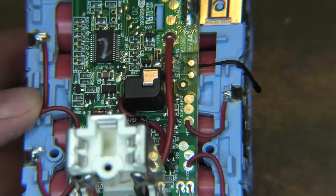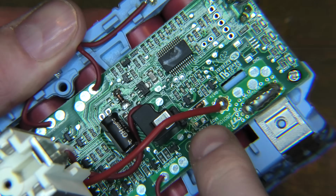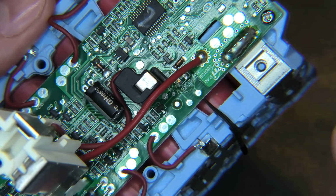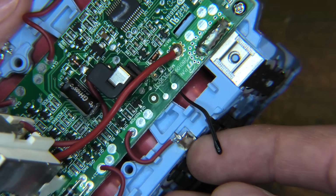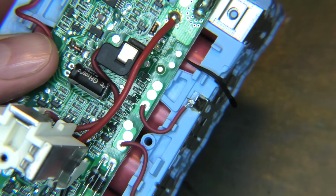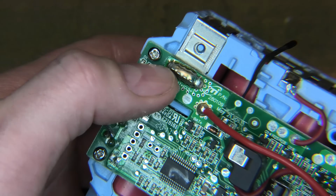The last thing I tried, I didn't record it, was this temperature sensor, and it's mounted up here, and there was like a red wire, just remove this a little bit. There was like some glue on top of that or something to protect it, and I couldn't get a measurement of that. I thought, oh, if that temperature sensor is disconnected, it might shut down the whole battery. And I removed that glue, and with big difficulty I did measure that it actually worked, and I could put my fingers on it and I could measure that the ohms changed with the temperature, so that is probably perfectly well. So that was a shame. That would have been an awesome fix.